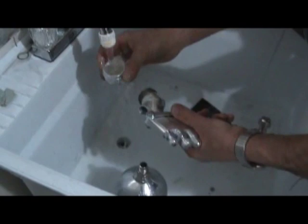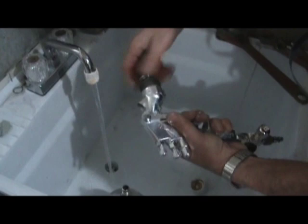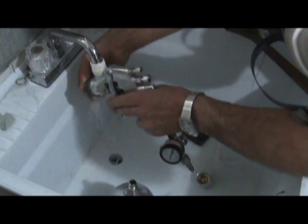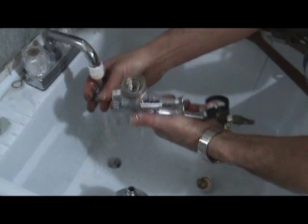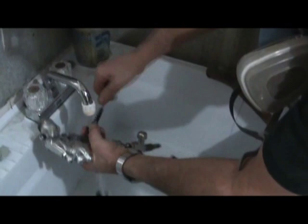On the gun itself, I like to pull the cap off and make sure the paint down inside the cap is all nice and cleaned off. Use a wrench and unscrew the nozzle, push that out, and then flush that part too. A lot of water going through really floods that needle and just cleans it right up. We've got a little wire brush that we use — if there's any buildup in there, just take the brush and wipe that out. And that's it — this gun's clean and ready for the next time.